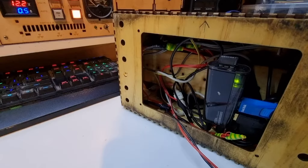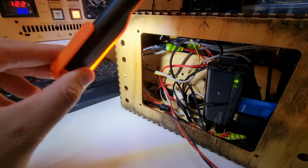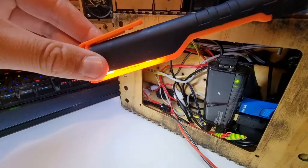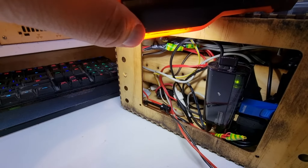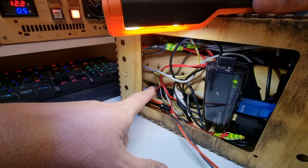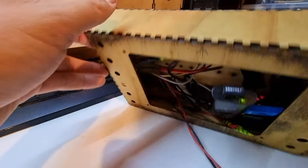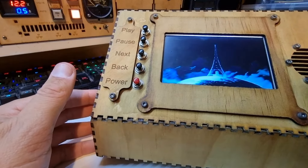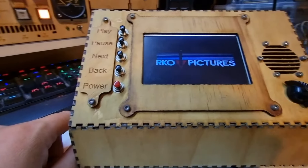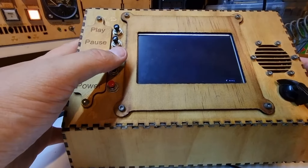That's why I have fuses on things. We're back in a minute. We didn't manage to kill anything and it looks like it's booting up fine. I think I identified the problem — there's that little white RCA plug there. I put a bit of Blu-Tack in the way to stop it sliding down, but I'm pretty sure the ground on that slipped and touched the side switch. That little white lead slid down and touched it — I'm pretty sure that's connected to the audio board and could have caused our problem and killed the audio. And now we have audio! It is a little bit picky at the moment so there might just be a loose connection.